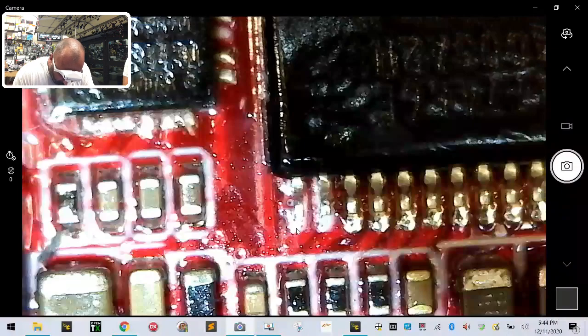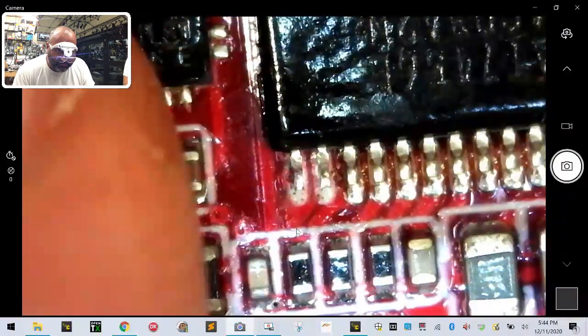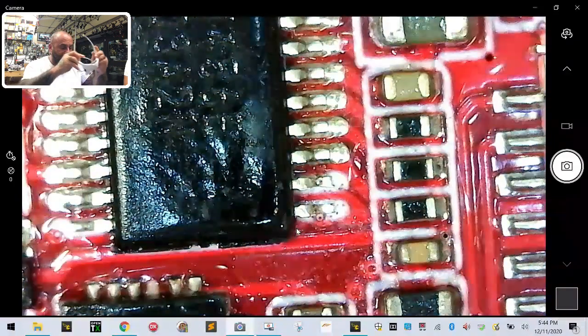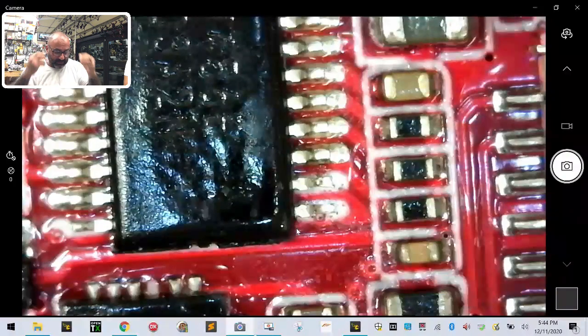I don't believe there's any more pad under there, to be honest with you. I think the pad was done short, because I'm looking right now and I can't find anything else to solder it to. So hopefully that'll give us a good strong hold right there and make those pins. But there's really literally no more pad under there to solder to. So in this case, this is where you end up possibly with things that don't last properly.